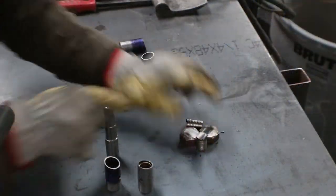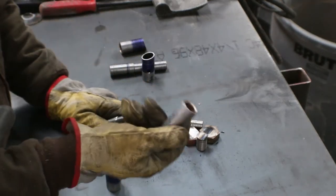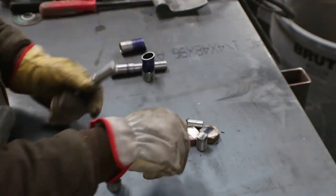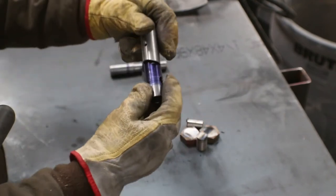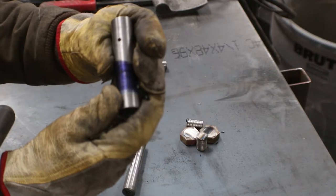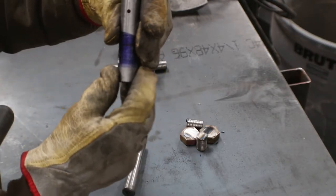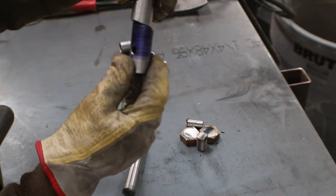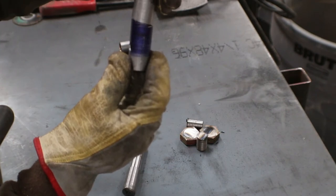Okay, well, we've got it cut off, made them fit to size, turned these bushings down, and I went ahead and pushed those in there, and I cut an angle on them, so when I cut it in half, instead of just cutting it straight in half, I put that angle on them. That set up there where the angles come together is the open position, and the closed position will be 90 degrees off, so that it'll have that point up there.